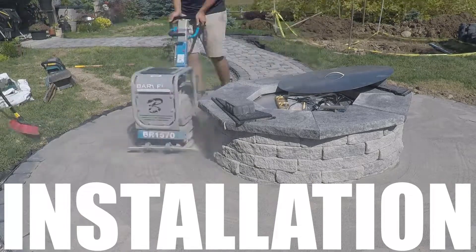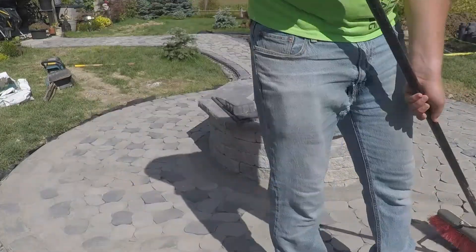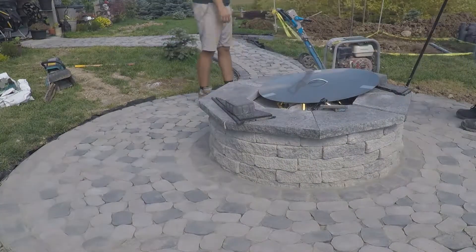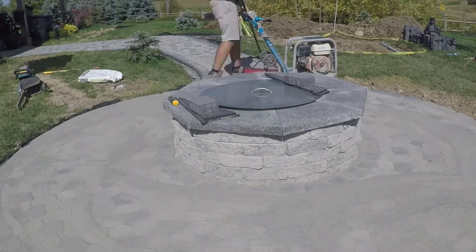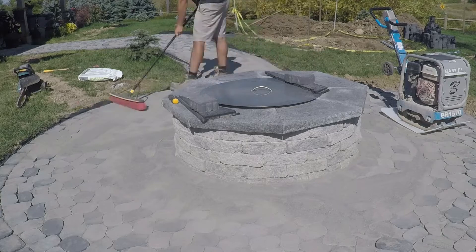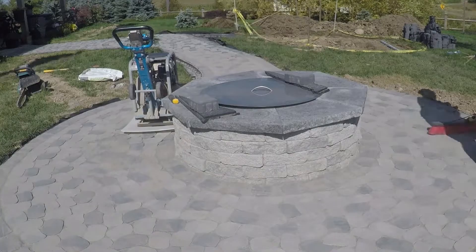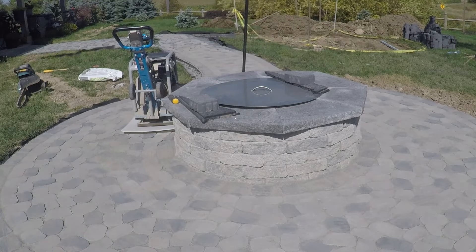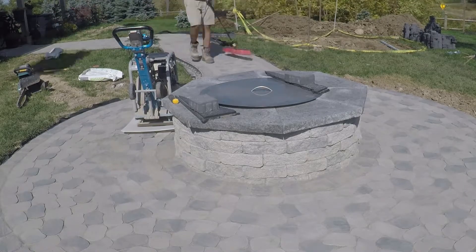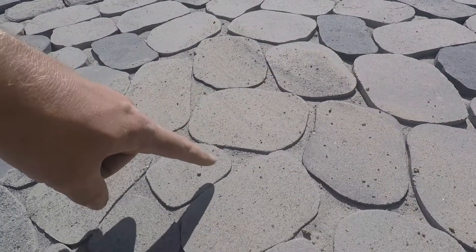Number three is installation — that means the sweeping, blowing, consolidation, and activation of that polymeric sand. Every manufacturer is going to have their own instructions, so always lean on those. For the most part, you're going to be pouring that sand out and sweeping it, and when you do, you want to pour that bag of sand over a wider area and sweep no more than 10 feet in any direction. If you don't follow this, you could be separating the ingredients of that sand over a wider area. Then we're going to consolidate that sand — strapping on a protective layer to your compactor or using a roller compactor, placing something over your pavers to prevent chipping and cracking, and running a compactor over those pavers to ensure the sand gets down to the bottom of the joint and you're seating the pavers into the bedding layer. You'll notice that the sand goes down quite a bit, and failure to consolidate will leave air pockets, which leads to erosion and failure.